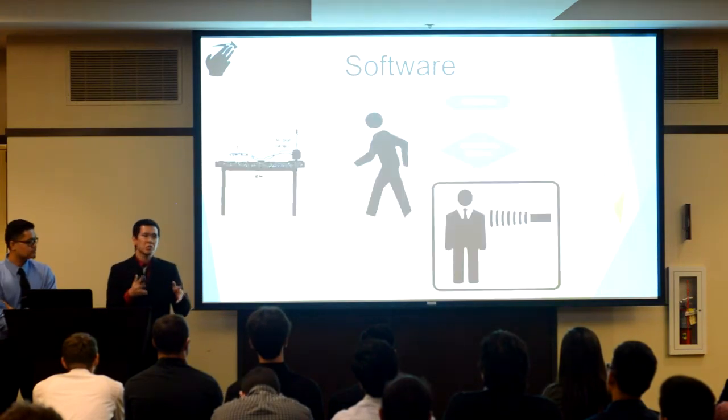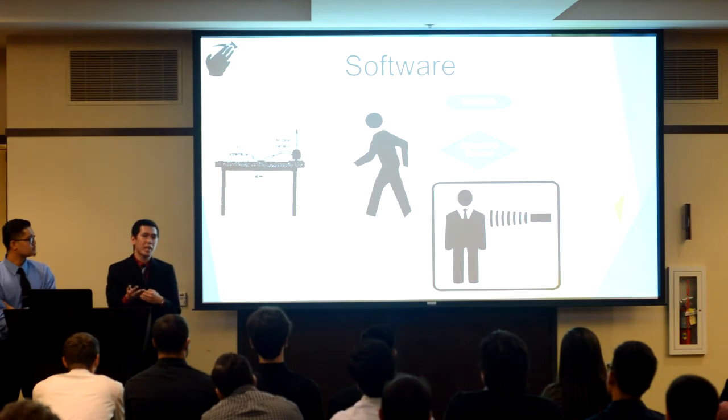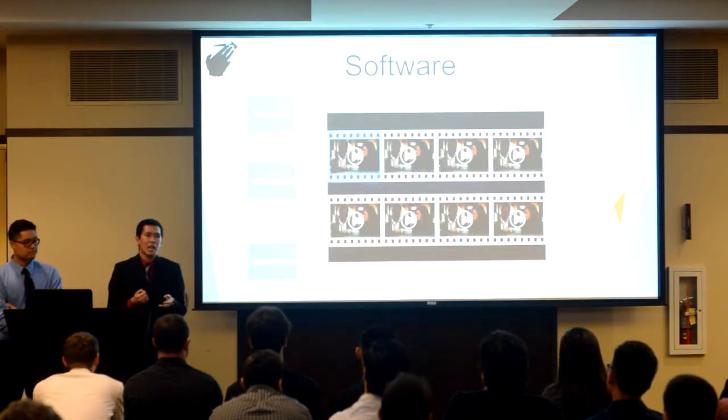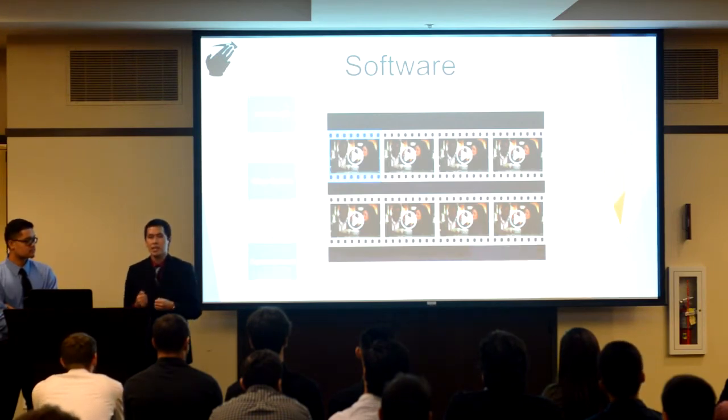To begin with, we use ultrasonic sensors to detect if a person is within range. If the person is a little bit too far back or too close forward, our system will readjust the person to the right spot. Then, our LEDs will begin blinking, allowing our optics to capture images and use these frames for image processing.